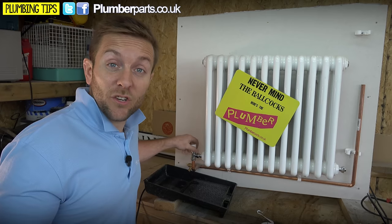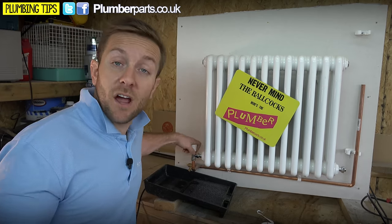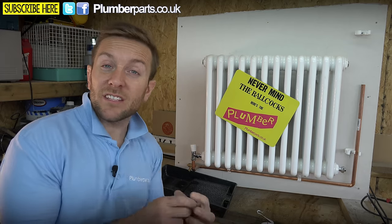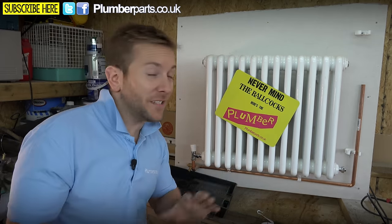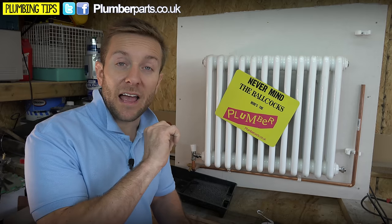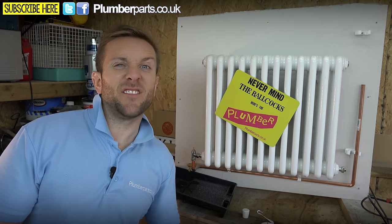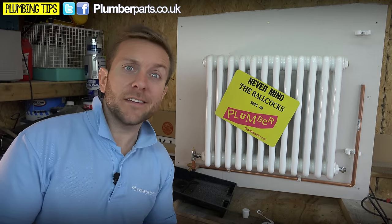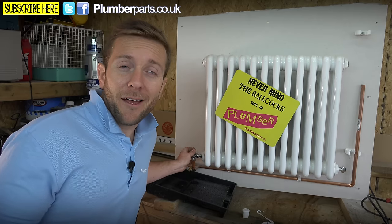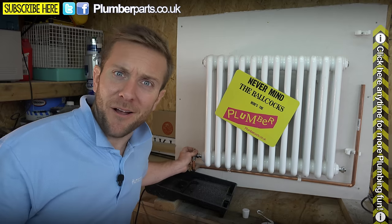The last leak to fix on a radiator valve is actually on this nut here — the gland, or packing gland. This fix also works for most types of TRVs, where you've got the numbers on the side and the twiddly bit. All you need to do is know how to take the head off — every TRV is different; specifically an old Danfoss type needs a little plastic lug pulled out and then a little Allen key undone. We've got our top off already. There are two types of fix: the quick fix and the slightly slower fix — call them the Jenson Button and the Lewis Hamilton approach.